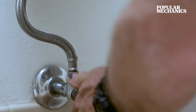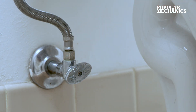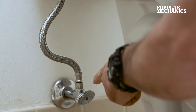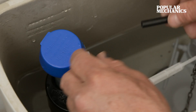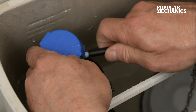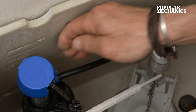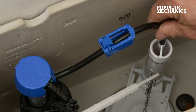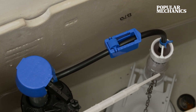Moment of truth — I'm going to turn this on a little bit to pressurize it and check for leaks at our fittings. If this is old on your toilet, say more than five years, might as well replace that while you're in here. Cut the rubber hose to the right size so that it won't interfere with the bottom of the tank top when you put the top back on. Catch it with the pipe clamp that's included, then tuck this back where the old one was and turn the water back on.